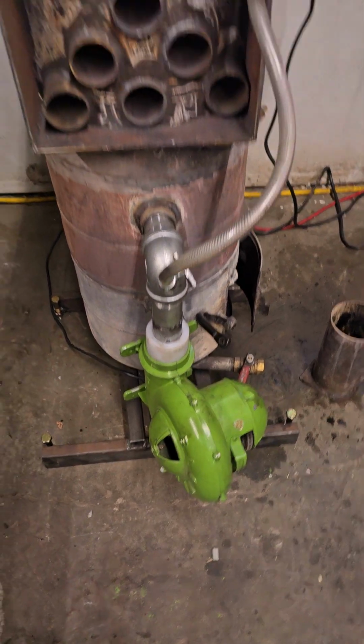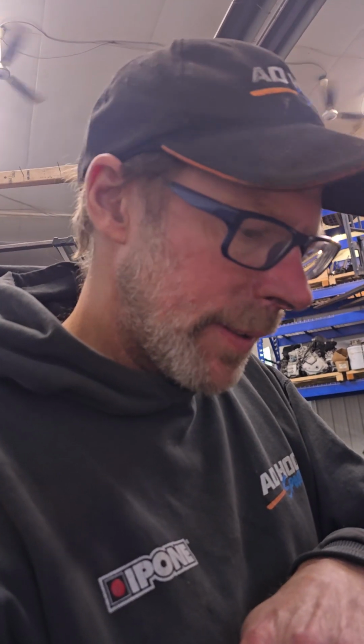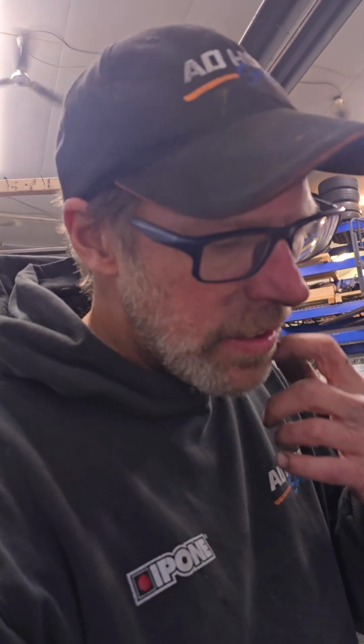because I made a lot of tests with the burners, and I found out that a straight cup with a straight 2-inch tube with a bunch of staggered holes in it was the best burn I could have, the best heat and the best clean. It's burning all the way to the bottom of the pot. I tried other square tubing with that. I'm trying to do a vortex, trying to get that freaking blue flame, but I have a white flame. It's very white and very, very powerful with no smoke at all, and it's making the same deposits in the pot.